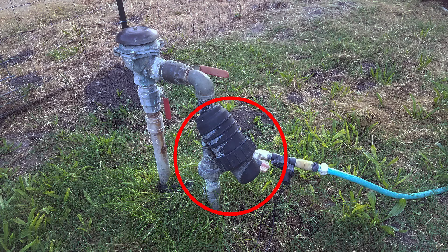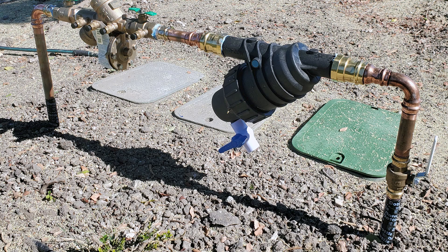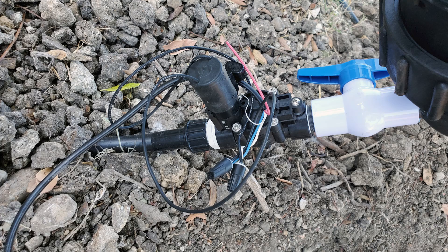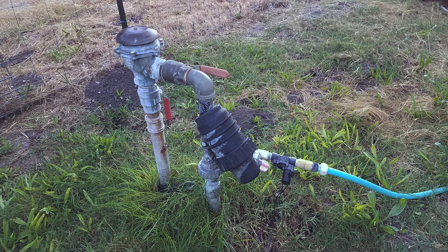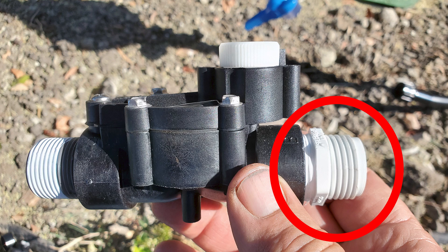The second filtration system is very clever. You don't necessarily need a backflow device as part of the setup, but here we have a filter with a three-quarter inch inline sprinkler valve attached to the bottom of the filter housing. This valve is wired as the last item in sequence on the sprinkler timer, so after all the other zones run, this will run for the one minute minimum, which flushes out the filter housing. He has a garden hose attached to a pipe-to-hose-thread adapter, but you could use drip tubing if you wish. Just don't put emitters on it to water plants because the emitters will clog from the debris. You'll need a place for at least five gallons of water to go each time.